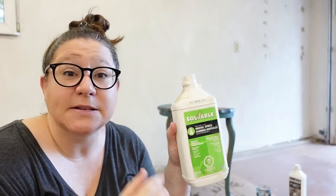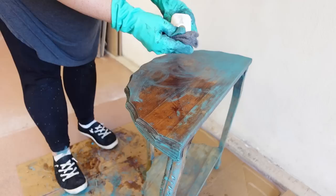There is the aftermath of two rounds of stripping on pretty much all of the surfaces. There's still a little bit of paint in some of the crevices that I think I might have to go after with a little bit of sandpaper. But right now I need to stop the stripping reaction, so I'm going to wash everything down with some mineral spirits and some more of my steel wool. That should remove any stripper residue, any remaining globs of paint, and just clean up the blue haze that I have going on right now.